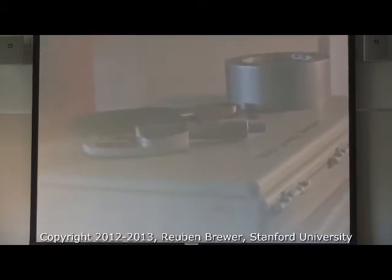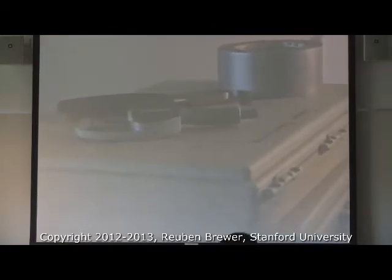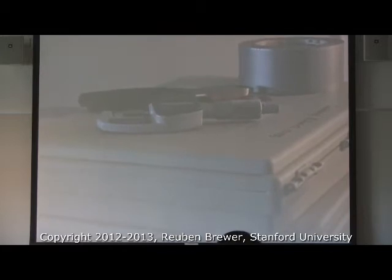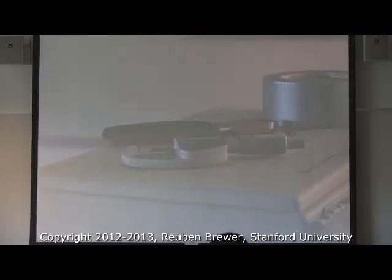Micrometers are only for making outside measurements. They make micrometers in various sizes — I was in a machine shop once and the machinist was real proud, he had one from World War II that was the length of this table. They range from half-inch to the size of a table. So that's external micrometers. And that ratchet is super important — using micrometers without the ratchet is as bad as just using calipers.